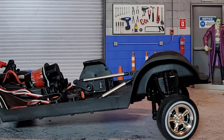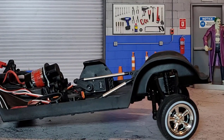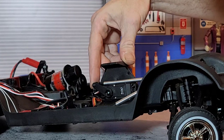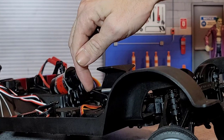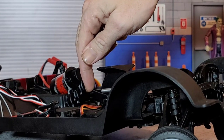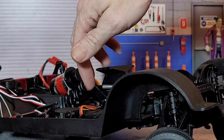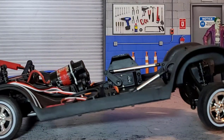No, not yet. Let's keep going. Actually, what's going on is I'm pulling on the servo over here. If you notice, when I get to the max, it's pulling this sideways because the servo horn's not connected, so it's not fixed. But when it gets to the max point, it's actually pulling that part there sideways. So we're gonna reduce that. Make that pulling stop.